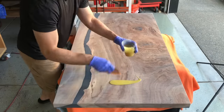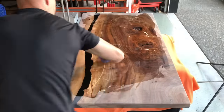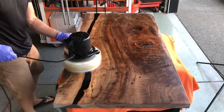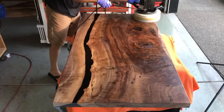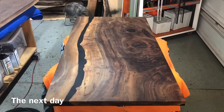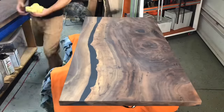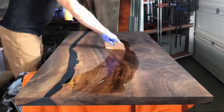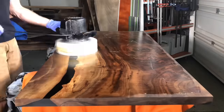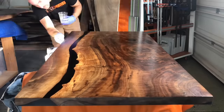I know I used to use a lot of Osmo and some other finishes too. Rubio Monocoat is the best one of all the ones I've found currently, and I will continue to research and try to find the best. I luckily have the budget to experiment with some of these more expensive finishes, whereas most of you out there can't really afford to spend a hundred bucks on a can of finish just to see if it's better than another hundred-dollar can. One of my complaints with Rubio is that you can't really continue to add coats to build sheen — they don't even really want you to apply a second coat. Osmo you can get a much higher sheen if you keep building those coats, so I did like that aspect. I wish Rubio would find a way to get this same protection and allow a build of coats like Osmo does.